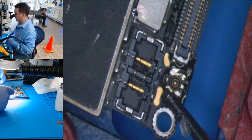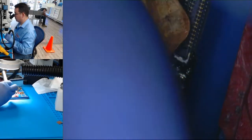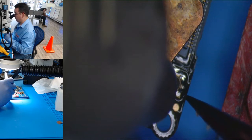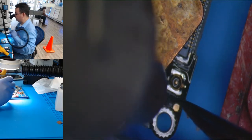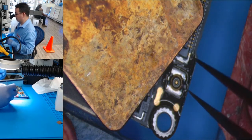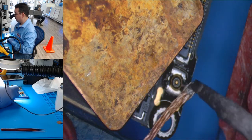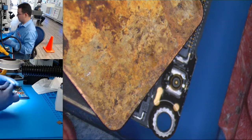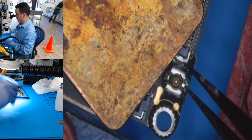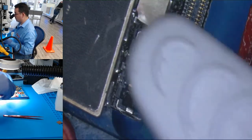Let's put some flux here. I just hold it, you see. I have 380 degrees with 35 on my station. I usually use the NIC 400 with 45, but this is perfect — that's it. It moves a little bit; let me clean that corner. Perfect — that's perfect, nice, very good.